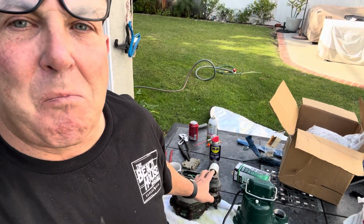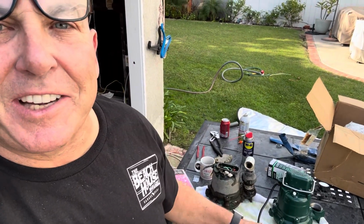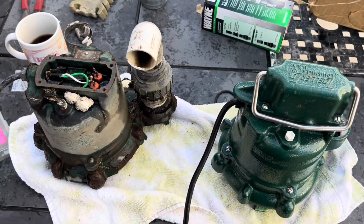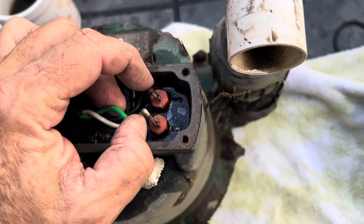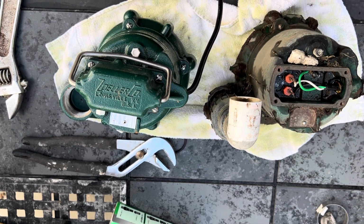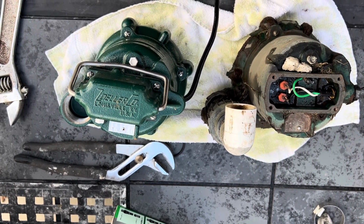What you're going to have to do is line up both pumps together, so you can figure out, not make any mistakes, right? Because the angles are super important. Some of those hoses kink and stuff. It's not good. So just put the pumps side by side and assemble them side by side. Make sure everything is the same, because it's so tight in that drain box. You'll have trouble. Here's the side by side. I think there could be some corrosion here with this connection. I'm not going to fool with it. Best to just take a picture at this point of everything side by side, just in case you forget what the setup is.